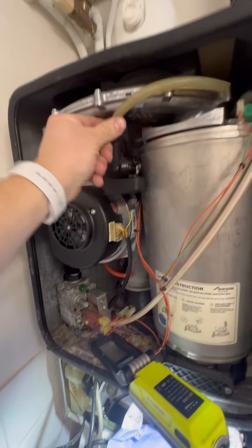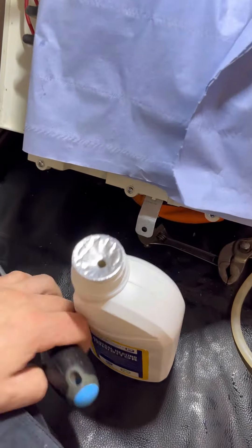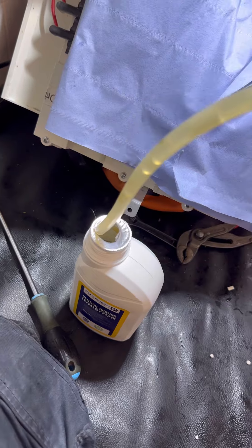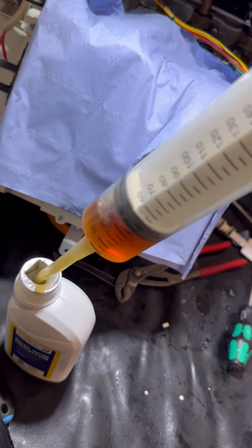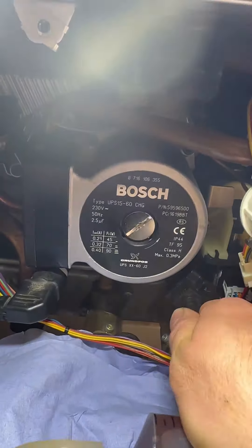Open the air bleed at the top of the heat exchanger — you've still got flow and return isolated at this point. Open the inhibitor, pop a hole in the top, then get a 150ml syringe and suck the inhibitor up into it. Open the drain off, insert the tube into the drain off, and then push it against your body to put the inhibitor into the system. Repeat until the whole inhibitor is in there, then when you've finished one just turn the drain off and repeat.